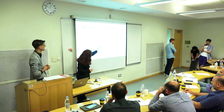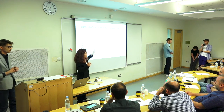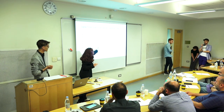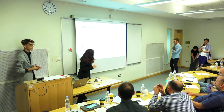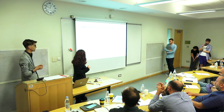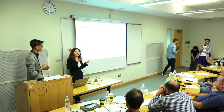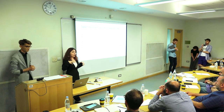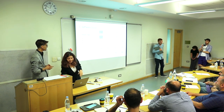So the energy consumed is the number there, 9.1, and we took a battery that would satisfy our needs, which is 14.8 volts and 5,000 milliampere-hours. The overall energy in that battery was the following number, and then we divide the energy in the battery by the energy in the switch. We find that we can display around 29,000 pages, which is 29,000 words of length 14, which is on average about 1/3 of a book, but we'll be improving.